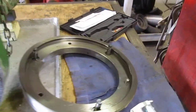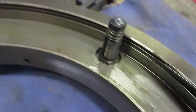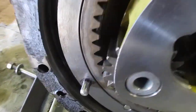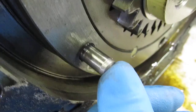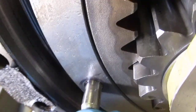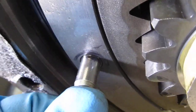John Deere recommends replacing the retractors — there are three of them on this piston — but that's not the problem. The problem why that piston will not go back in is that oil over time builds up behind this pin and will not allow this pin to fully seat in its hole. The machining is so fine that the oil will not pass. We can see it is not locked up, just will not go in.